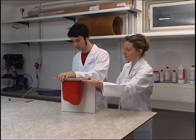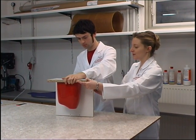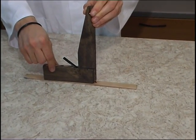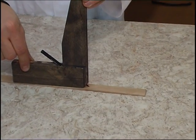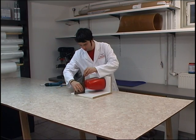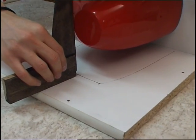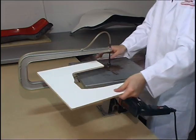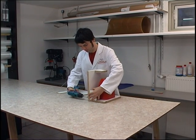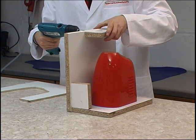A second plate is attached parallel to the mould's parting line. The component's contours must be projected onto the parting board with the aid of the angle. This angle features a diagonal hole for guiding the pencil. Our parting board takes the form of a coated particle board. The projected contours are sawn out with a little oversize. Spacer blocks position the parting board exactly to the height of the parting line.